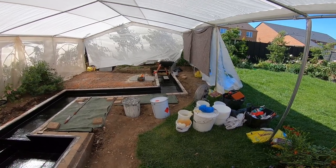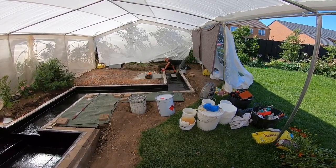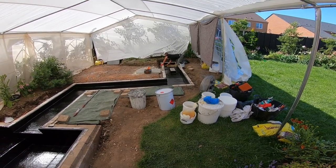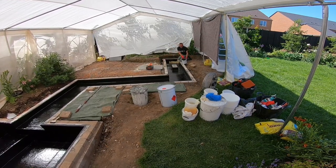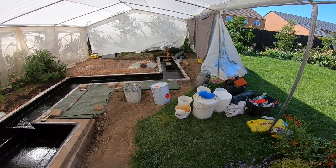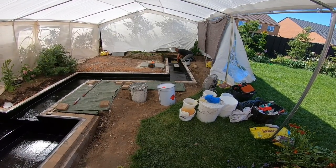There's a little stepping stone at the top of the job and I haven't flow coated the top of it because the customer wants to put a slab on. That will be mortared down, so rather than try and bond mortar to the incredibly smooth waxy surface that flow coat is, I've just omitted the flow coat from the top — which is above water level anyway. At the very end there's a little sump chamber with a return pipe, a little bit deeper than the channel I'm working on — about two feet square and about 15 inches deep. An interesting little job to work on.